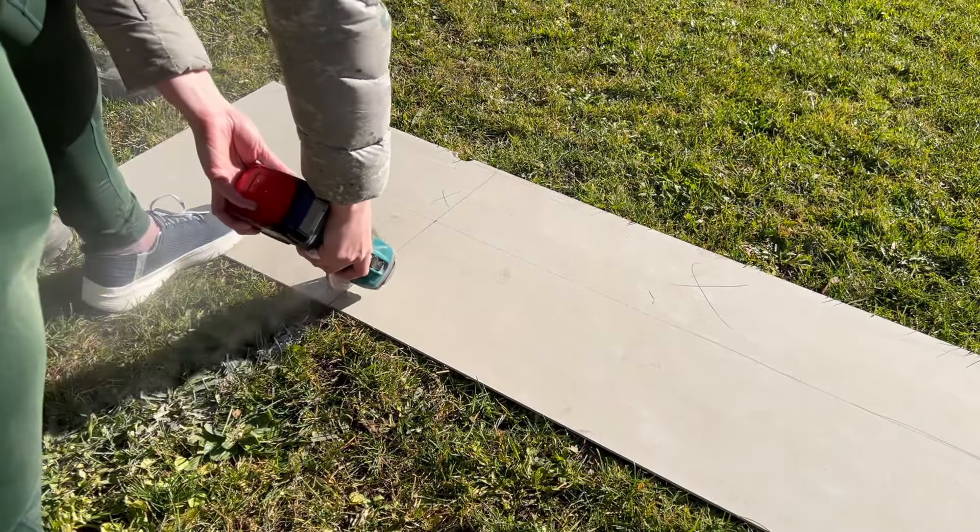I then laid the last floor tile in position and the floor tiles are looking absolutely spectacular — they turned out just as good as I thought they were going to. The pattern and the design really makes the bathroom pop and the light colors really help to add a little bit more light and ambience to the room. I'm not quite done yet though — I need to do all of the silicone and the caulking in the edges where we don't apply the grout. I go along with the silicone gun and apply the silicone to the edge, and then scrape off the excess to try and get a really nice line. Depending on what I'm working on, I either use my finger or a paddle pop stick to remove the excess silicone. In this instance I did both — I went along with the paddle pop stick first and then behind with my finger to remove the excess.